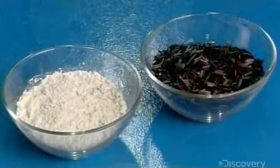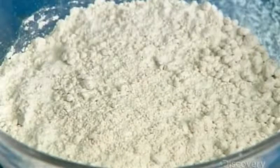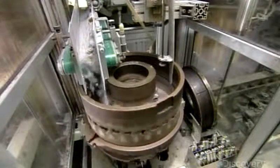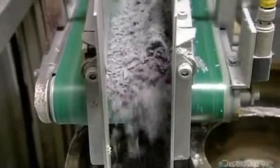The disc factory prepares the carbon fiber by mixing two ingredients: a heat-moldable resin and chopped pieces of raw carbon fiber, the strength of which lies in the interweaving of its minuscule carbon filaments. Automated machines pour the carbon fiber into aluminum molds in the shape of the disc ring.